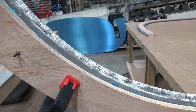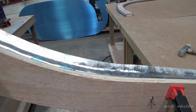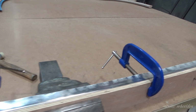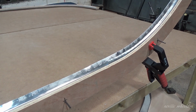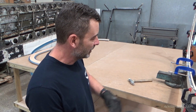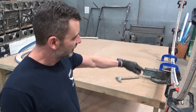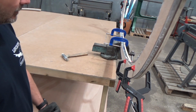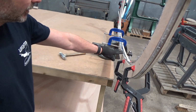Dave's got it in the vise and has already knocked it over once and stretched the material on the inner curve. On some shots, the light reflects on part of it that is knocked over, making it look convex, but actually it's concave. Initially I knocked it over once, then I stretched it all the way down. And then this back part here goes over fully on the second pit. So it'll go over fully this time then, will it? Yeah, I'll just tap that down now.